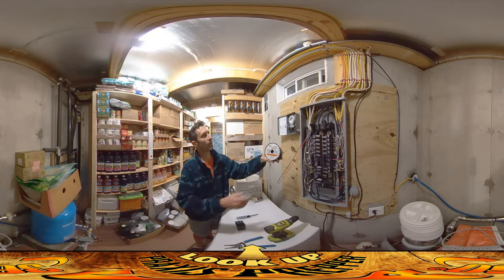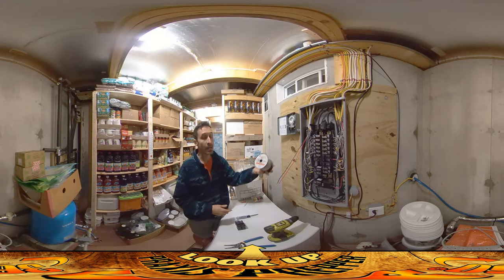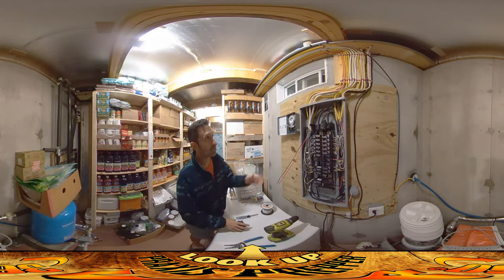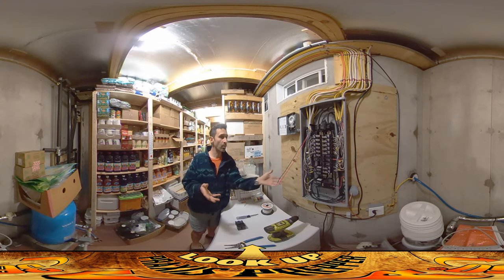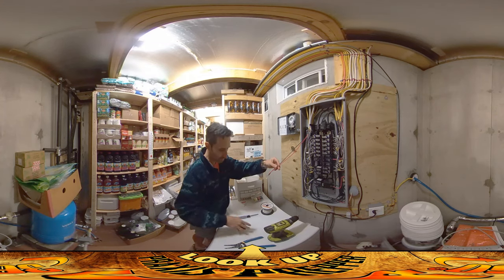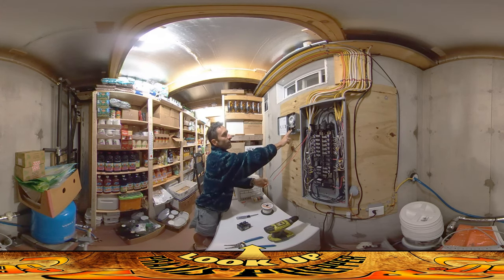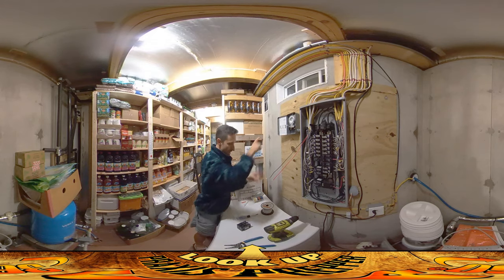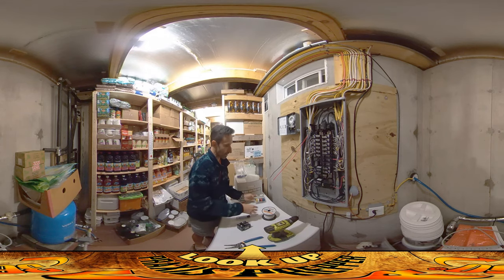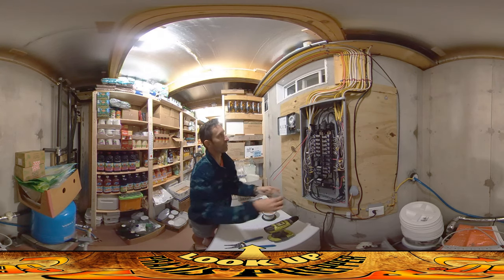The wire I'm gonna use to hook all this up is this — 10 gauge stranded THHN wire. I don't know what THHN means, but apparently it's fine for this purpose, and it's a braided wire inside. The orange wire comes in here with three wires plus the ground. Two of them — the red and the black — are the hot wires that had gone into the breaker down there. I'm gonna run these into this guy, they'll pop up in here, and then I'm gonna add two more wires. I'll color code them — one will be black, one will be red by wrapping a little tape at the end — and those will continue down and plug into the breaker.